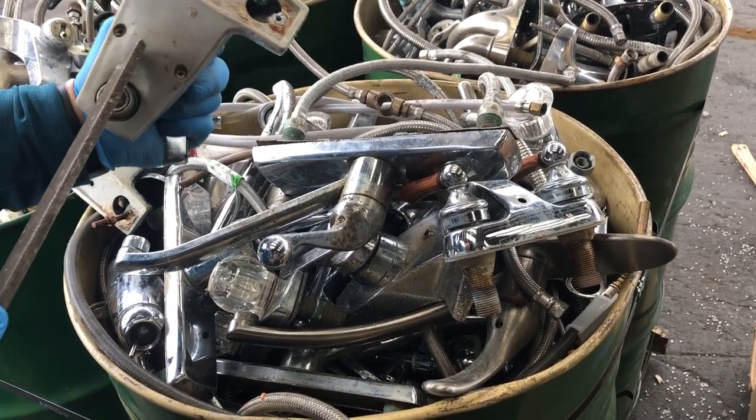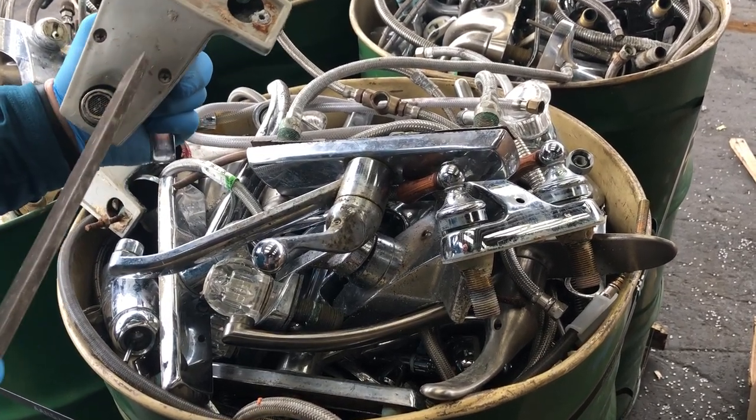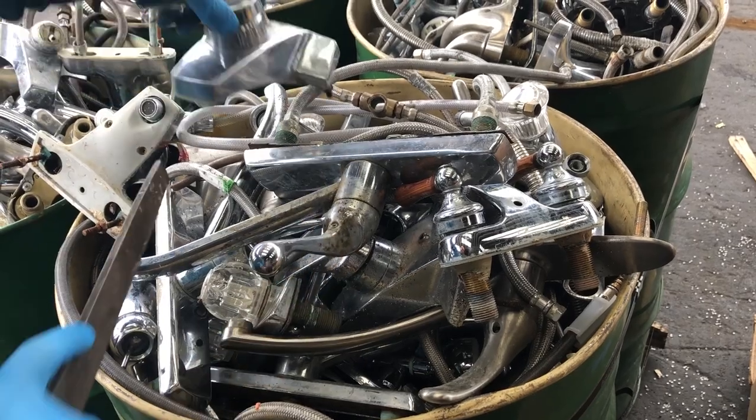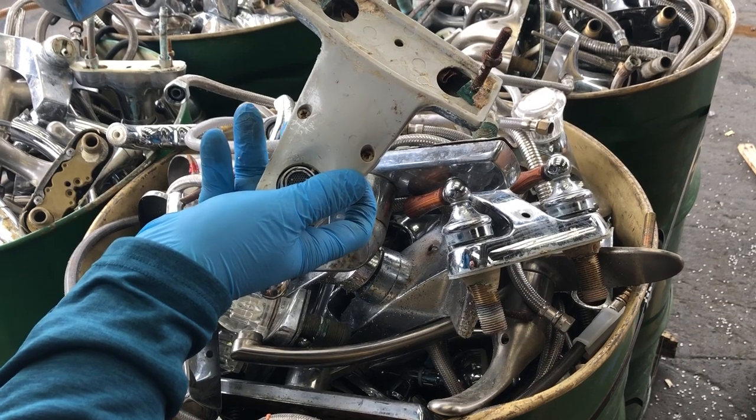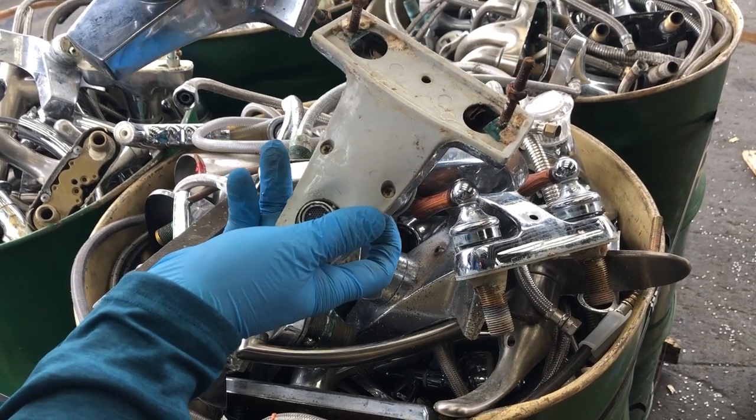Underneath you'll see large pieces of plastic and there's only a small piece of copper and brass inside. So when it looks like it's brass on the outside, when you look underneath it's actually plastic and die cast — where this whole thing used to be brass.